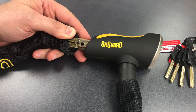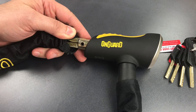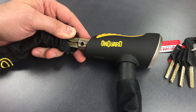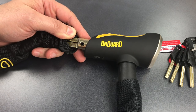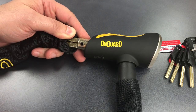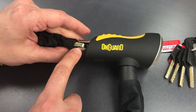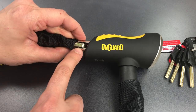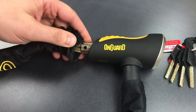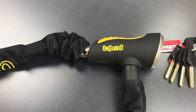However, given the number of locks that I tear apart, I have developed a couple of approaches to removing them. These range from the most simple, in which I put a machine screw right down the center and use a slide hammer to pull it out, to the far extreme, in which I've used an auto-body stud welder to weld a stud to the pin and use that to pull it out. Another approach might be to use my open-ended nut splitter to spread this U-bracket apart, but I think that removing the pin is probably the path of least resistance here. So let's head down to the garage and see if any of them are practical attacks.